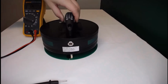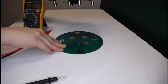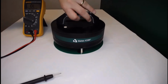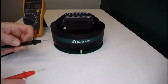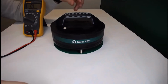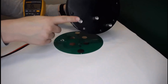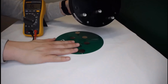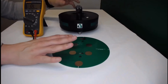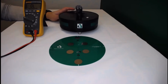Once the process is done for one of the directions, we're going to follow the same procedure that we typically take during the verification procedure, and then we're going to turn the device and test it again. So the goal here is to check the continuity on all 6 contacts between shafts and metal plates. Once this process is done, we were able to check if all the continuity is indeed in accordance to the specification.